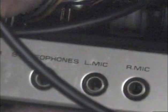So here's a picture of the broken mount, and let's see if we can peek inside the unit, and you can see that mount. The top is completely missing from that mount. You can just barely see it amid all the wiring mess I've got over here. But anyway, we'll take a little close-up, and I'll show you what I do to repair this bracket. This applies to nearly all units that come in with a plastic head mount bracket. They are going to get this treatment because it's just the best solution for long-term reliability.